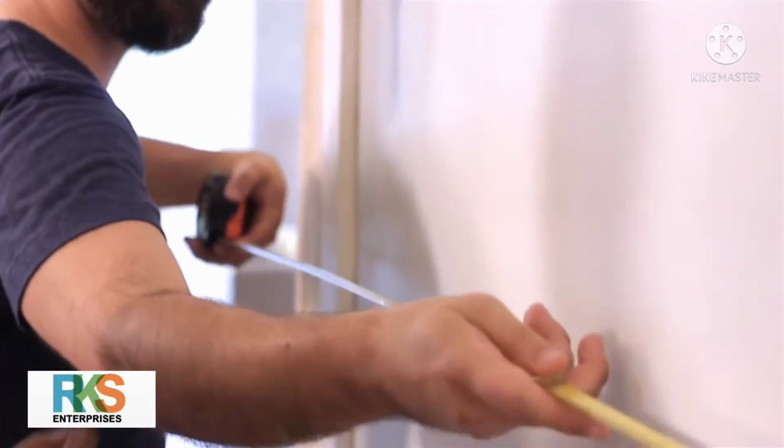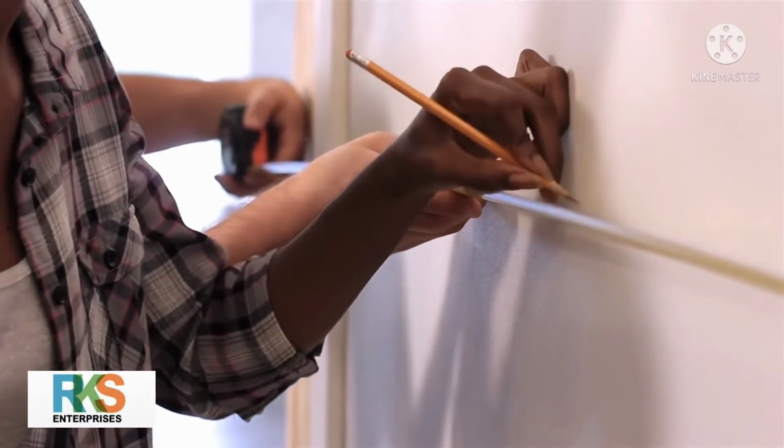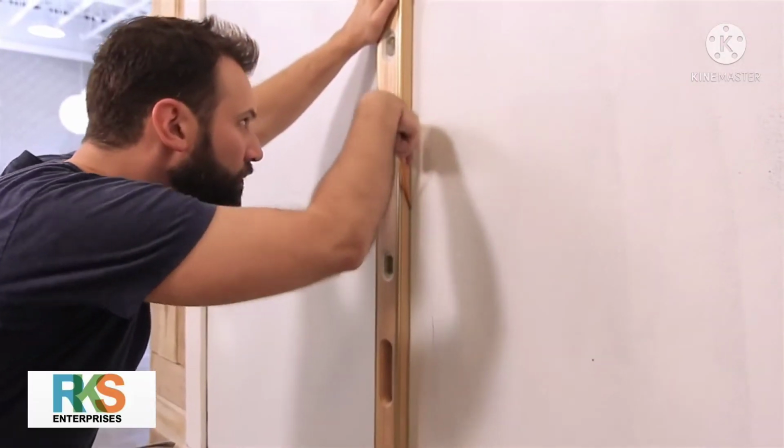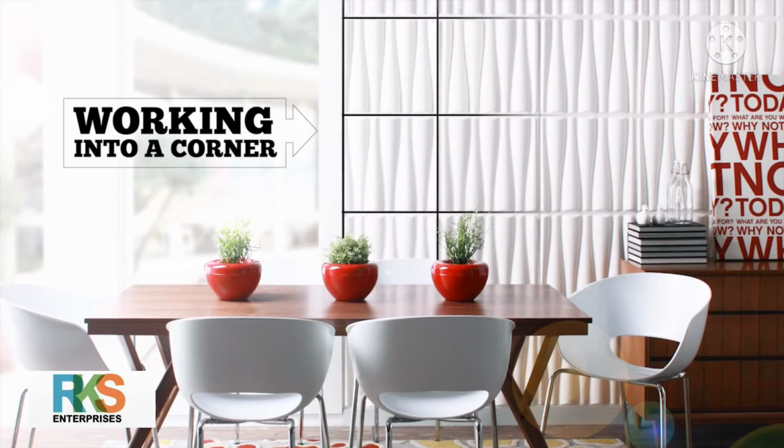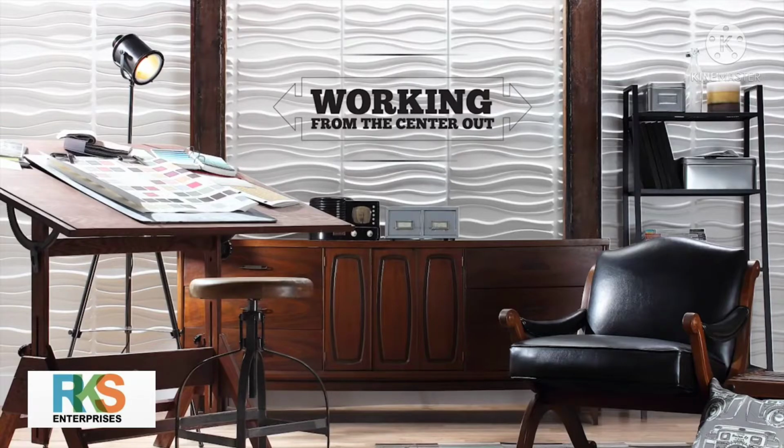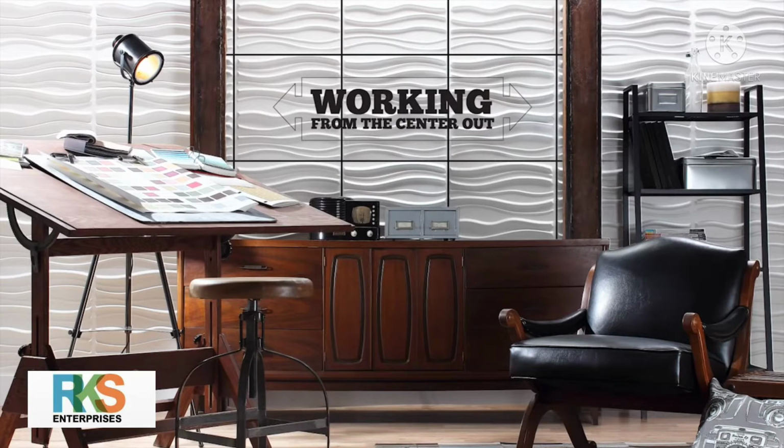Take wall straightness and other obstacles into account. Use a level to mark the wall with guidelines to ensure proper positioning. If working from an open-ended wall into a corner, start with a full tile and work into your corner. On a wall-to-wall install, work from the center out toward your corners.